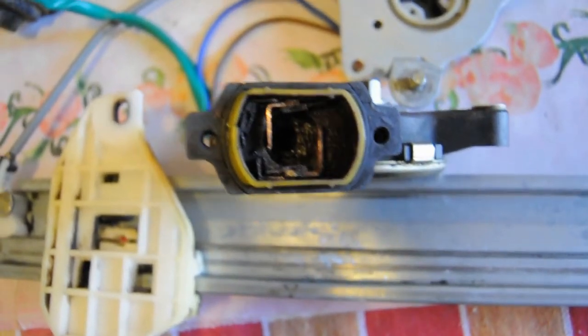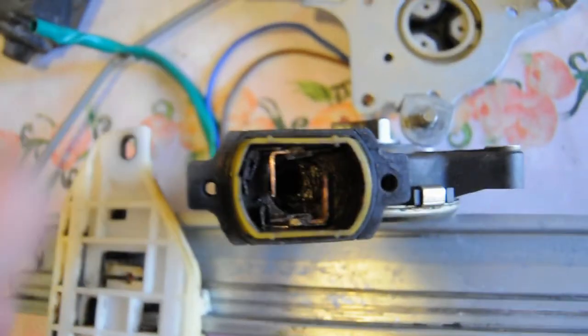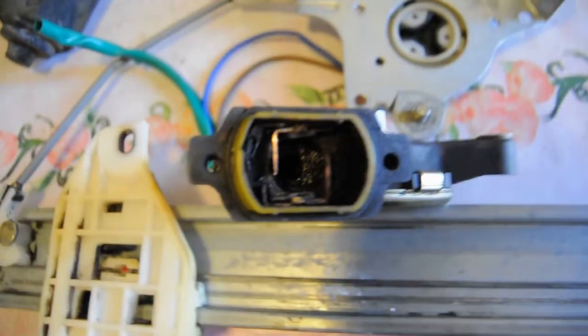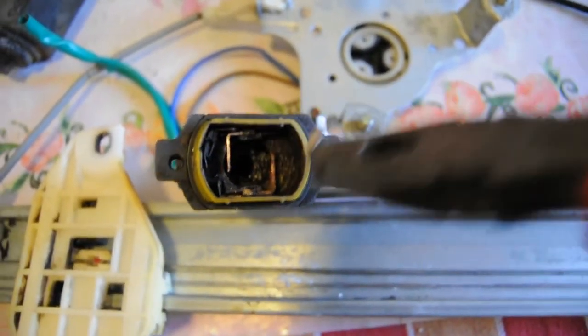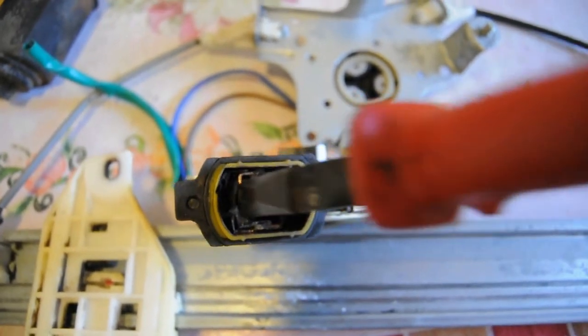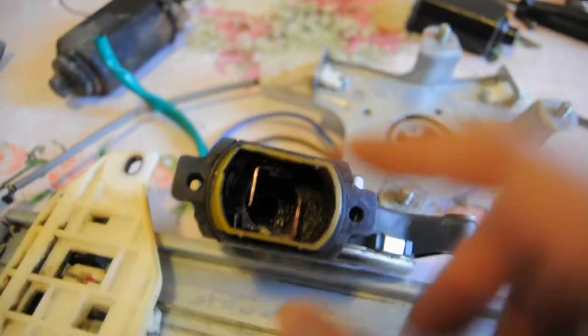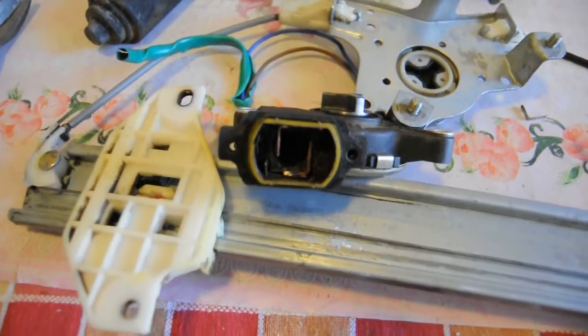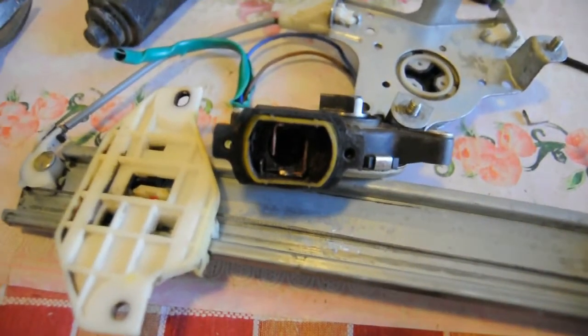These two are my newly made copper brushes, but usually what you are going to see here is something that looks broken. To remove those two, just get a pair of pliers and pull them out — they come out of a slot on each side.